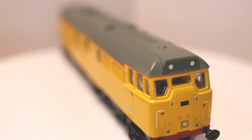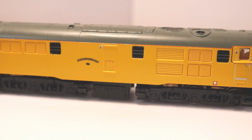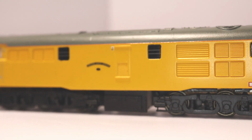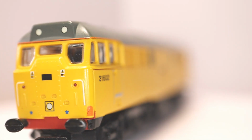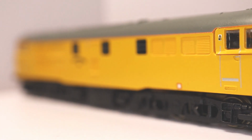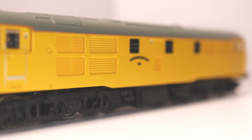The first Class 31 entered service in November 1957, after the launch of the Class 20 locomotive, and was one of the pilot scheme locomotives ordered by British Railways to replace steam traction. They were originally built with Mirrlees engines and Brush electrical equipment, but the engines were not successful, and in 1964 D5677 was fitted with an English Electric 12SVT engine. The trial proved successful, and between 1965 and 1969 the entire class was re-engined.